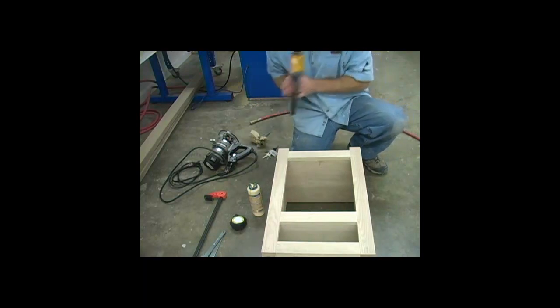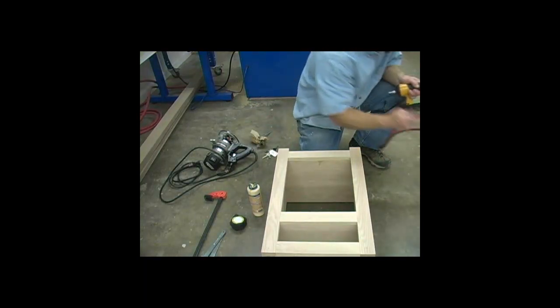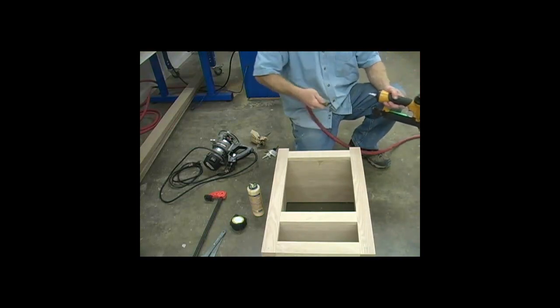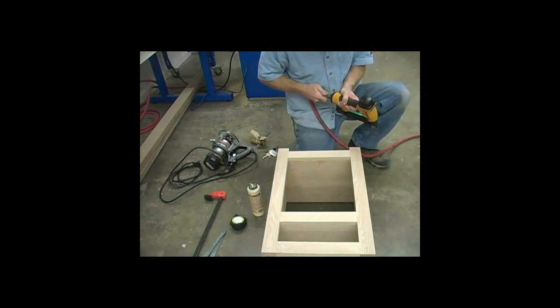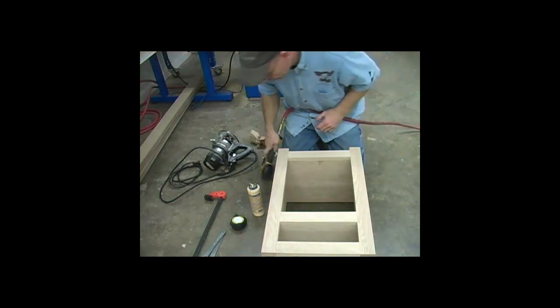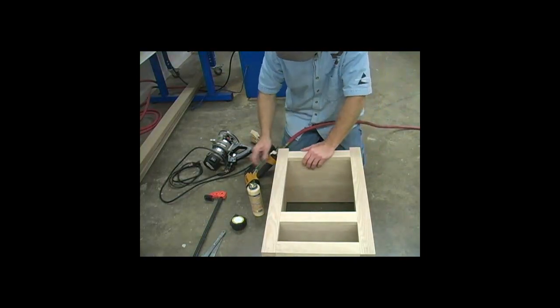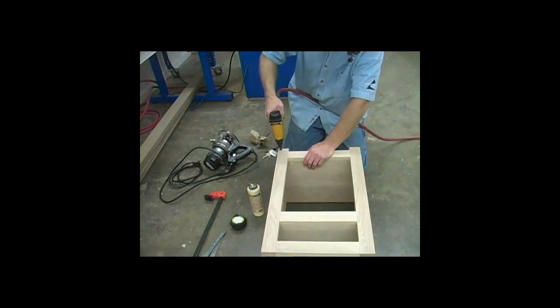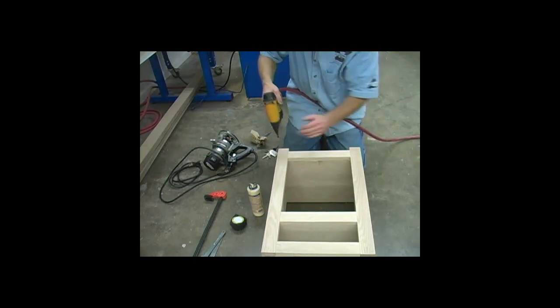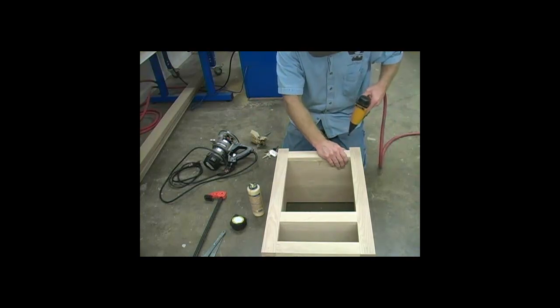Okay. Need to plug my air hose in. Pull back on the spring clip. Push in with your wrist. Shove. Slide the spring over. That attaches real nice. And let's see. We're still good. Just press. Right in the corner, not too far over. Don't want to blow out. Nail straight down. Don't angle your gun this way or that way. Catch your other corner.